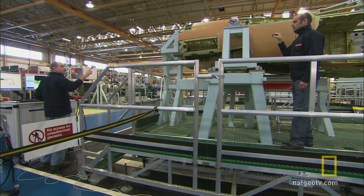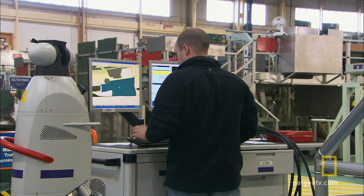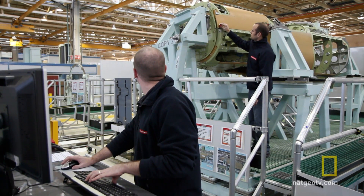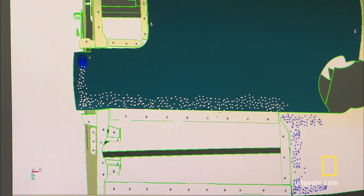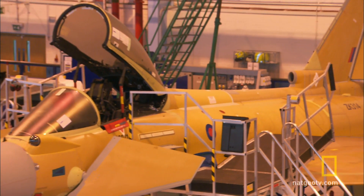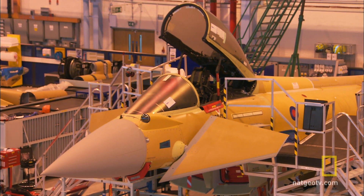And it's not going there until these guys say so. They check for tolerances. One of the biggest challenges for the Typhoon's engineers is making sure every part of this model lines up perfectly, no matter where it's made. Many aircraft are allowed a 25mm lateral difference along the line from the tail to the nose. The Typhoon is accurate to within 1.5mm.